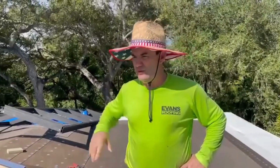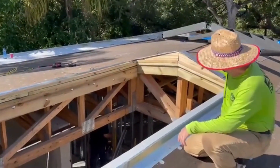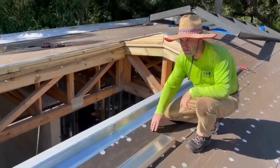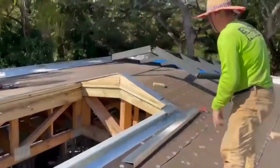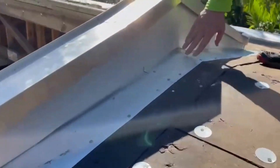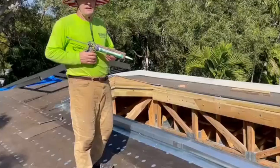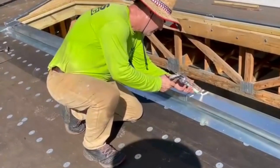It's time for the installation of the curb. We installed two 2x4s together, and on the two gables, we installed a wood riser. Then we put a 3x4 flashing to secure the face and to make the connection to the existing roof. On this section, we are going to receive a 90-pound layer. On the sides, we put a double layer of flashing — one flashing covering the other. And under the perimeter, another layer of flashing to receive the curb framing that is already prepared here. Every area where the flashing overlaps, we put a double layer of cold sealant.